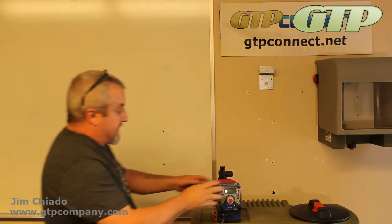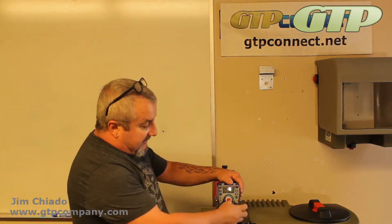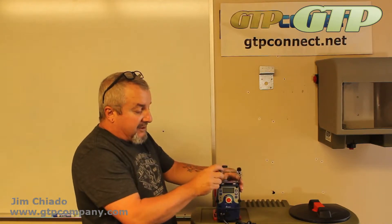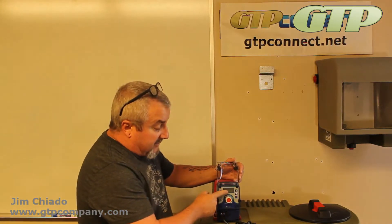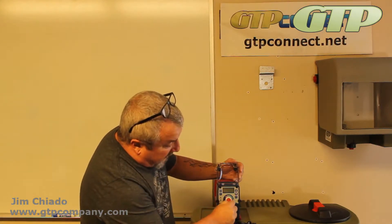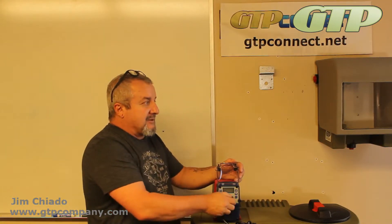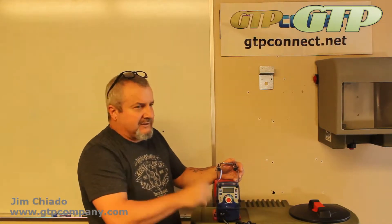Now that we've gone over some of the accessories, you'll notice this pump, unlike some of the others, does have a down screen cover. There is no lock line, but it does have some bolts to screw it down. The digital display is 0 to 360 or 0 to 100 percent. It also has stroke control — 20 to 100 percent. Below 20 it's not as repeatable, which is why manufacturers mark that range in red on the stroke dial.